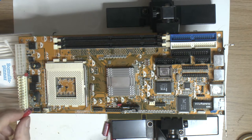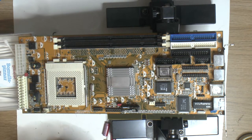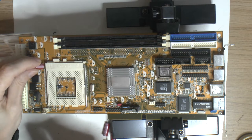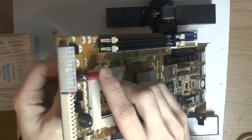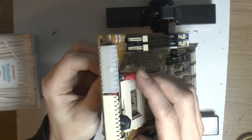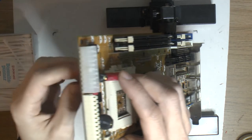And on this particular board, the negative white stripe goes to the white on the board, so it's fairly straightforward on this one. Like I said, it can actually be the opposite, so I have to be cautious about that. I actually think these are taller too than the original ones. And they're higher voltage, 10 volts, which is fine.